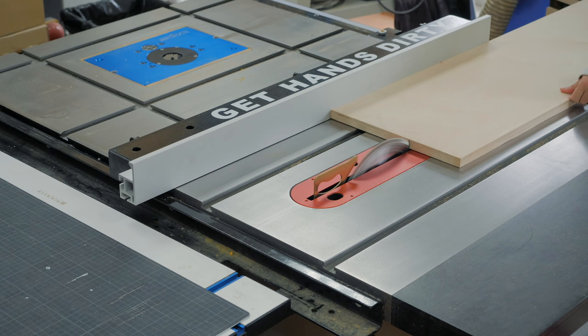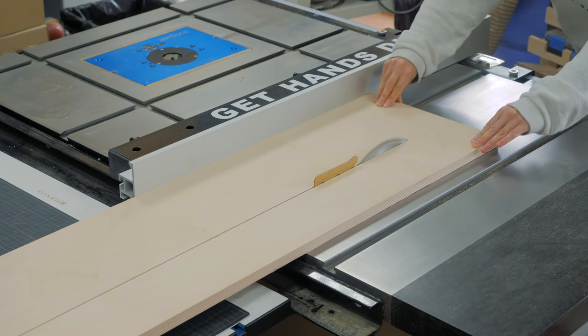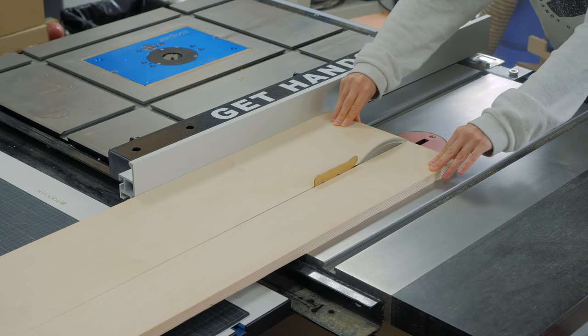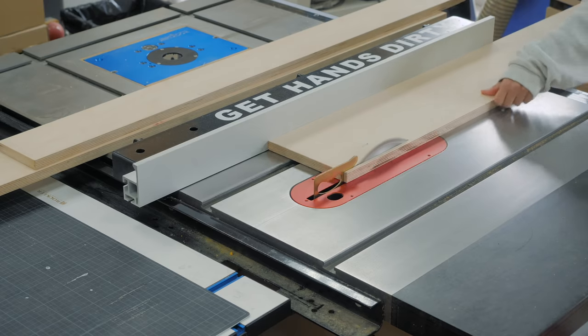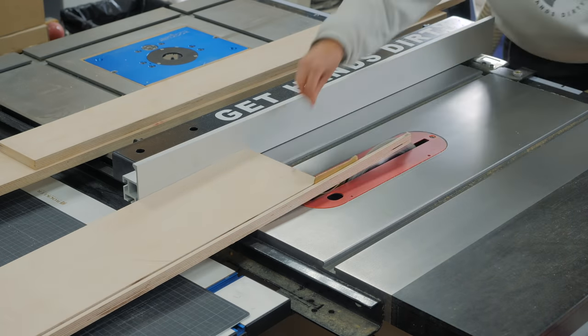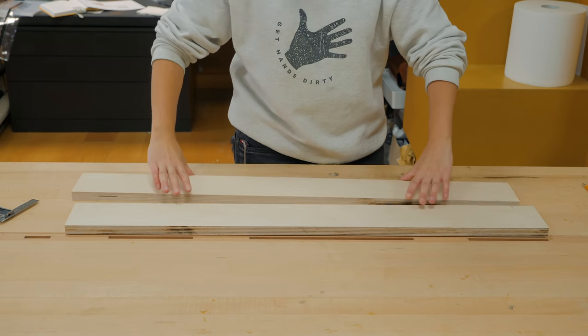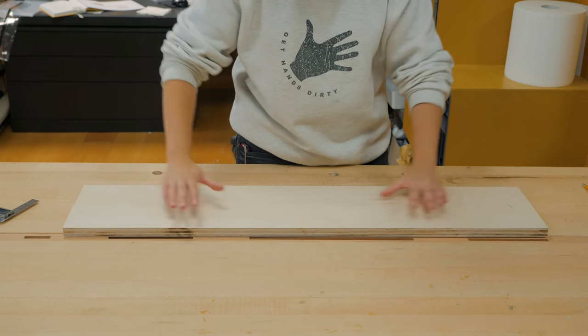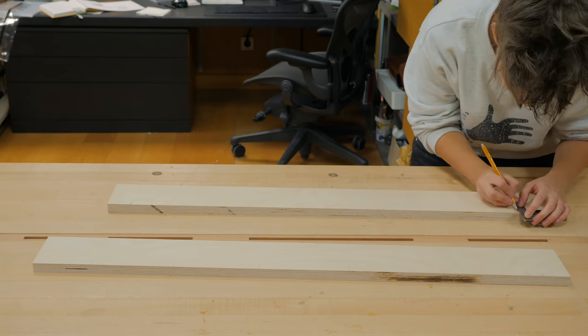While I have to wait for the panels to glue up, I can keep cutting the fronts out of 18mm Baltic birch plywood. My kitchen cabinets are all made out of birch and yellow MDF, so I kept the color scheme here too. Because I'm using scraps and only had enough plywood to make two fronts, I combined two strips to make the third front. The halves were quickly joined with floating tenons and glue.